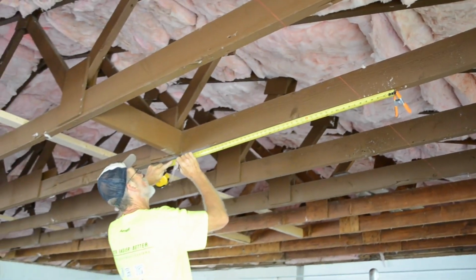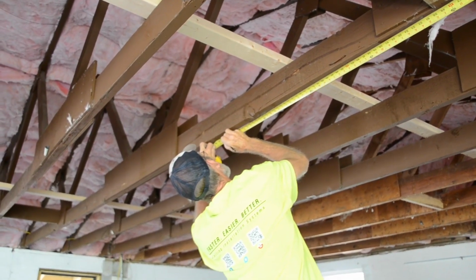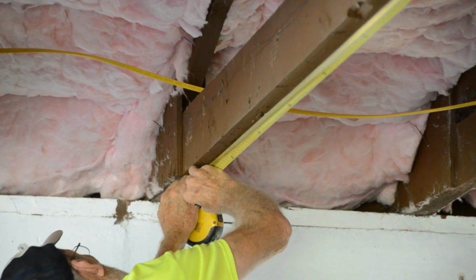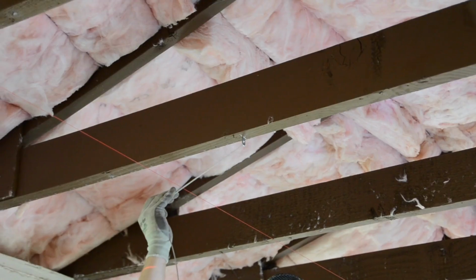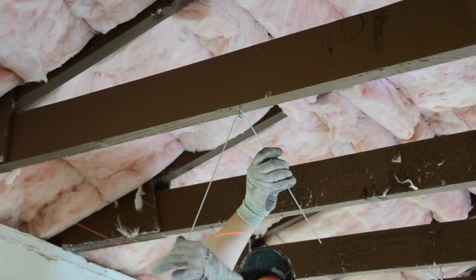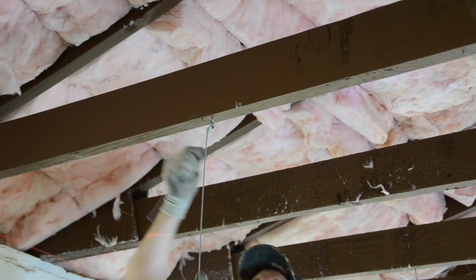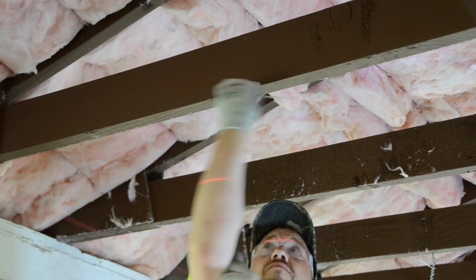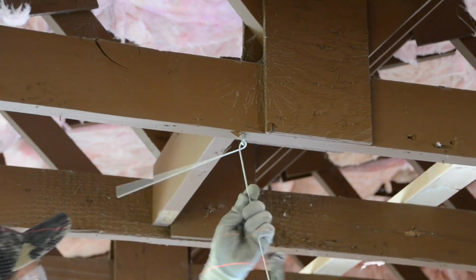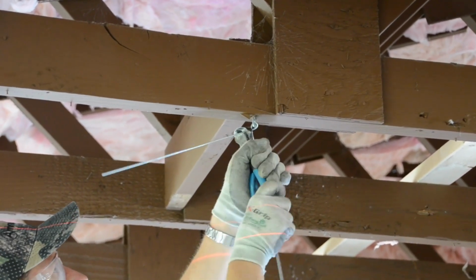Without the dry lines, it's difficult to know where to install our first run of hanger wires. Here, we are tying wires to the eye-lag screws, but you may be shooting wires with a Hilti gun into concrete deck. After your first run of wires, simply move over 4 feet and install your second run, and so forth. Tying wires is easy, provided you leave a long tail that you can bend up into a handle for easy wrapping, 3 wraps in 3 inches.